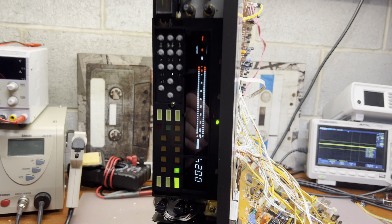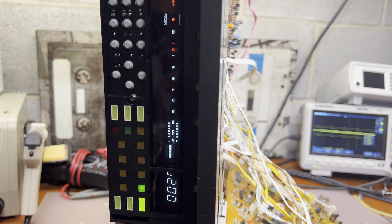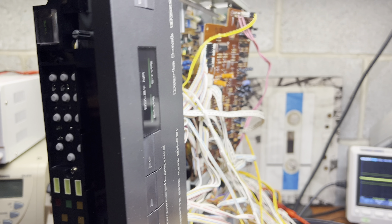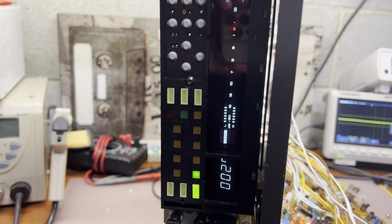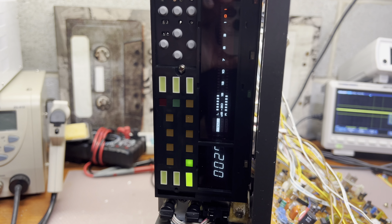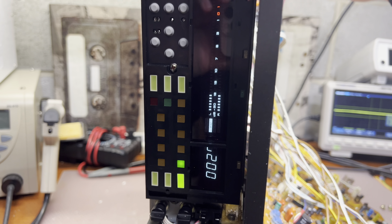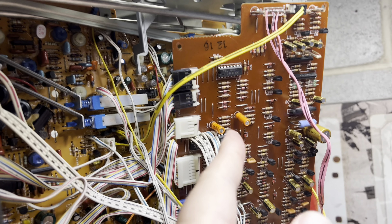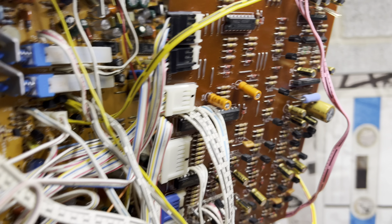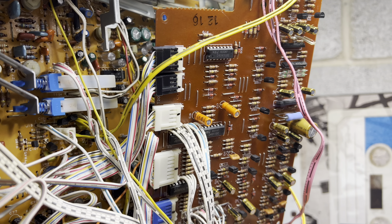Good news — it still works. Bad news — we still have some levels. Probably capacitors need to be replaced. I hoped the broken traces were the root cause, but apparently not — there is still a level offset that won't go away. Recapped — all new caps except the 0.47 microfarad bipolar ones, which I've never seen before and couldn't source, so I kept them for now.